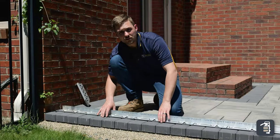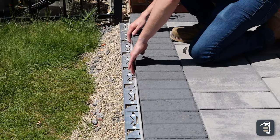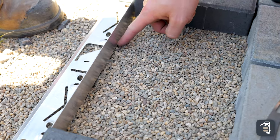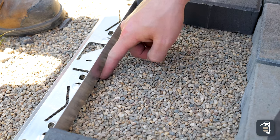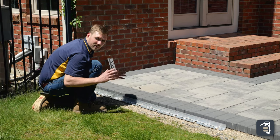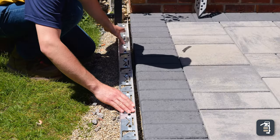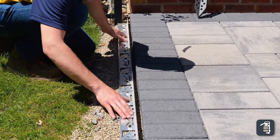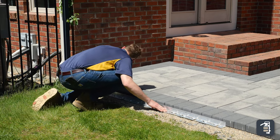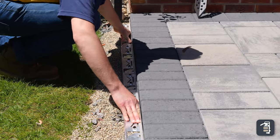A couple tricks when installing the hybrid edging. When you're setting the hybrid edging in, don't just set it there. You'll see once we pull these pavers out, there's that feet angle. Since we took it down a half inch, the stone is about a half inch under. Instead, what we want to do is keep the edging about half inch to three quarters of an inch away from the edge, grab onto it, shuck it back and forth, and kind of push it back into that edge. That's pushing that number eight stone back underneath the pavers.